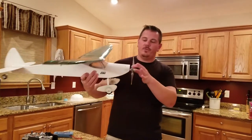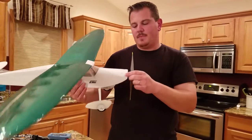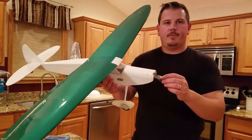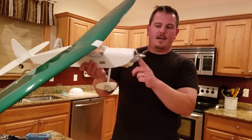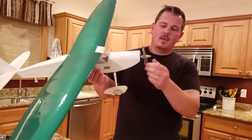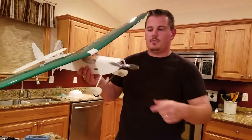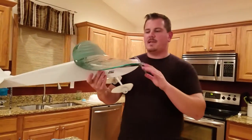I have two holes drilled here to get to the mount. They're 1/16th of an inch set screws — maybe it's some strange millimeter size, but I couldn't get any of my millimeter sizes to work. Then PropSaver with collet, and I'm running a 10-7 APC style standard direction prop. You don't need a 10-7 though — you could probably get away with a 10-5 easily.